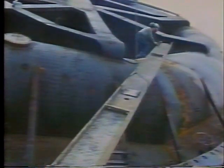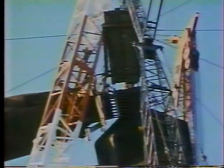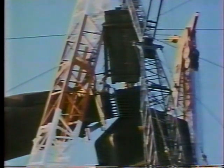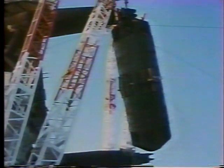With the tests complete, the structure is rotated hard to the east and held there with temporary kicker beams which brace it from the main deck. A complete unbalance will be set up when the load tank comes off. The tank is drained and it is easily cut loose from the yoke arm on the bottom.